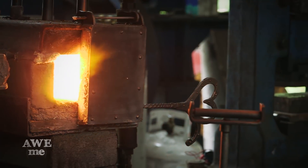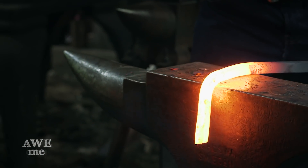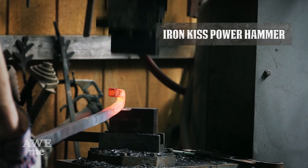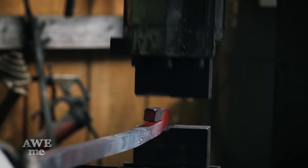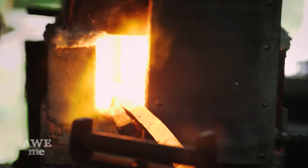After reducing the stock, it's now time to start forging in that heart. He'll be using a lot of classical blacksmithing techniques during this stage. Afterwards, he'll bevel it and turn that into a really sharp blade. After folding the bar over by hand, he's going to the Iron Kiss Hammer now to crisp up that point. In order to get that heart shape, you've got to make two crisp points — not only at the top of the heart, but at the bottom.